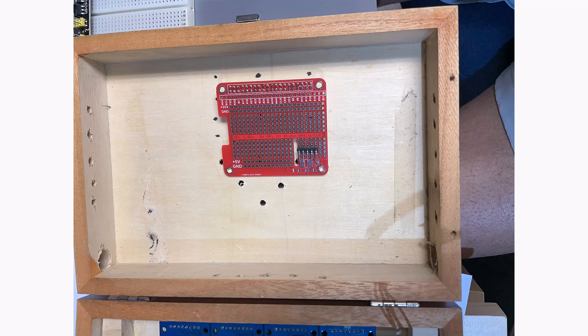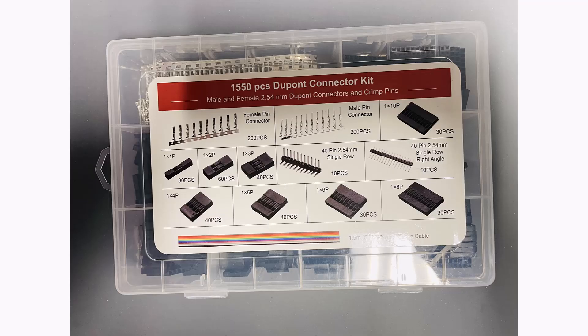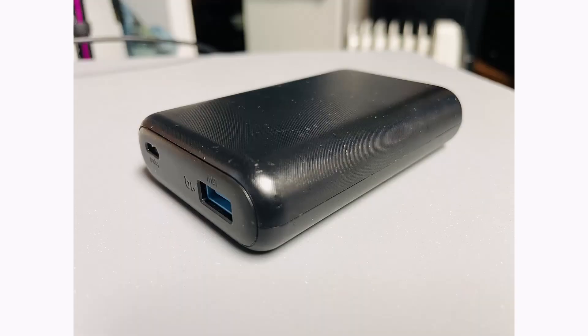There is a reason for the breakout board. Since there are so many wires, I didn't want to go through the hassle of connecting individual wires to the Raspberry Pi pins. So I decided to solder all those wires onto this board, and then this board goes straight on — it has a 40-pin connector at the bottom which goes straight onto the Raspberry Pi. Removing or disconnecting the wires makes it much easier. Also, a DuPont connector kit will come in very handy. Buy a very good crimping tool — I have included the link below. It's very important that you have a good crimper. And of course you need a battery bank to power your Pi.